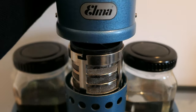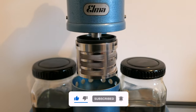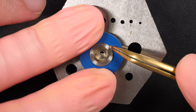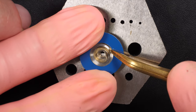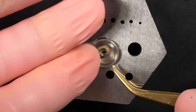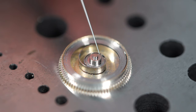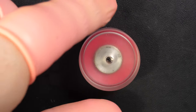The parts are now fully dry and ready to be assembled again. First I'll put a new mainspring — I just press it inside the barrel. This mainspring comes already lubricated so you don't have to add any lubrication in the barrel. It's a T-shape so you have a bar that you need to align in a groove. I put some oil on the barrel arbor because with rotation we re-oil all the rotation and contact points — metal against metal — just to make sure everything moves smoothly and doesn't wear too much. That's it, closing the barrel assembly.